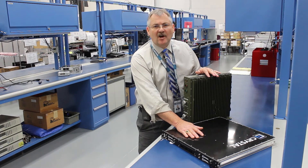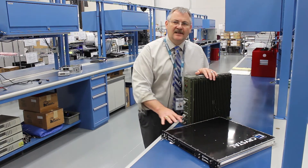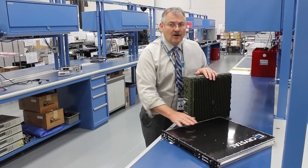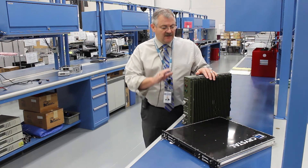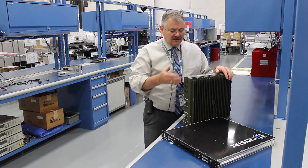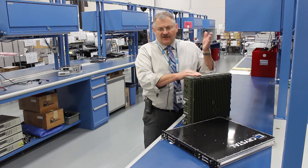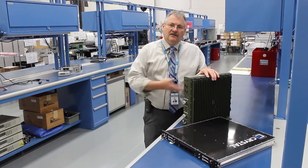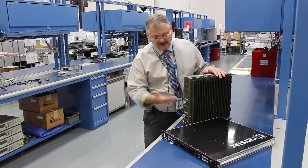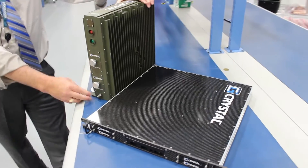You can see here we've got a standard carbon fiber unit — it's an air-over-components design — whereas that obviously would not bode well for an immersion type of environment. While it's conformal coated, it probably just isn't going to live. Whereas our SE16 here, which is rated to the immersion spec, is much more capable of withstanding sustained submersion for an extended period of time with no issues, because we're using the right kind of connectors and the sealing and gasketing necessary to keep water out of the system for full operation.